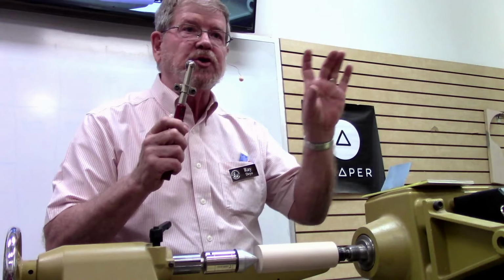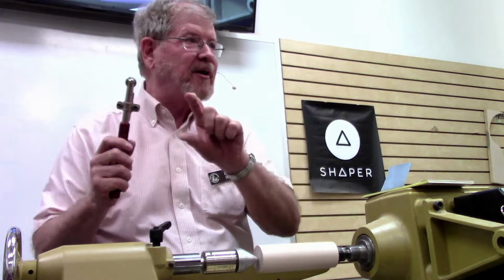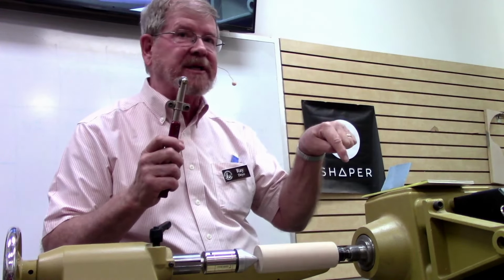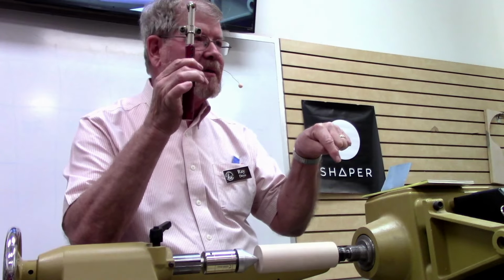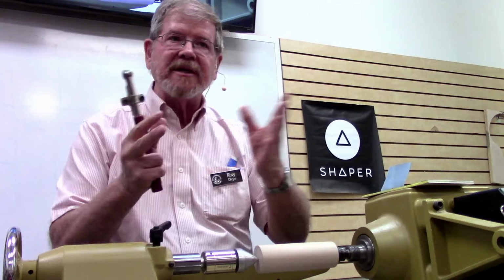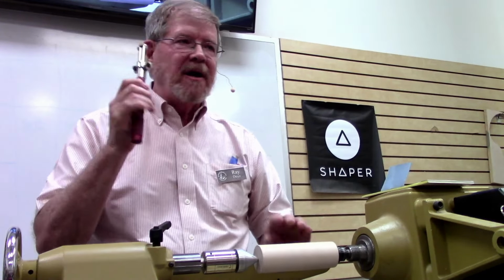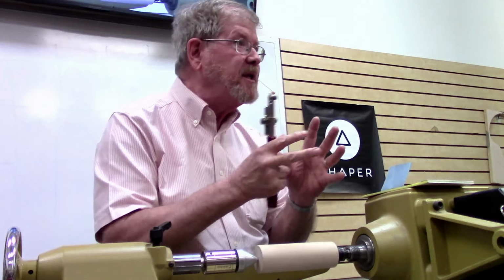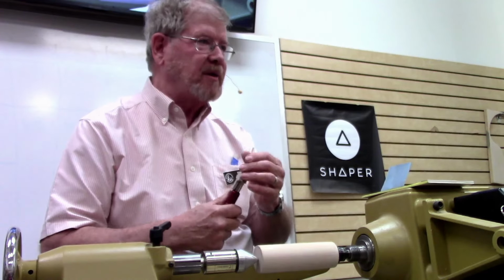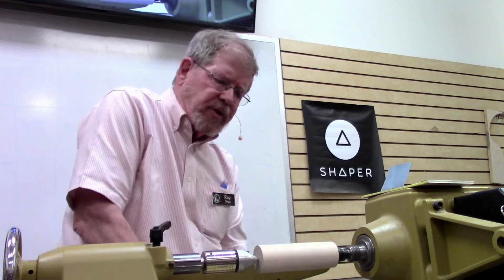50 millimeters, or 2 inches, 500 RPMs. It's easier to remember 5,500 than it is 2,500. So if you've got something 2 inches in diameter, your speed is 500 when you're using this tool. The bigger the diameter, the smaller the speed. So you're going under 500 and vice versa. So it's a slow tool, a slow cut, and you want a very slow speed. Yes? Does that change for using the large? No. So it's the same thing? Same thing. Okay. 5,500.